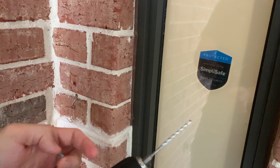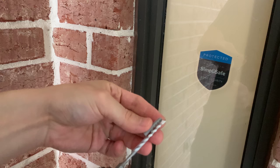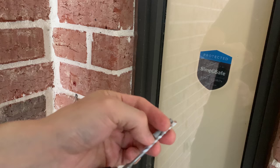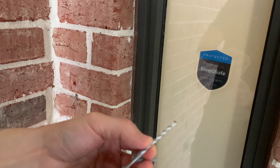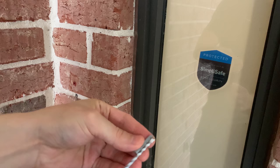As I mentioned, you should start with the smaller drill bit first. When you first start, put a little tape — using the wall anchor provided by SimpliSafe — to mark where the end is. This is how much I need to drill in, from the tip to this point. The tape I have is a bit translucent but I know where it is. Just keep that in mind: you should do something similar so you won't over-drill or under-drill.